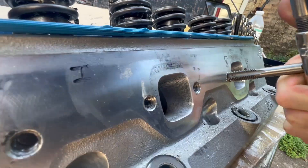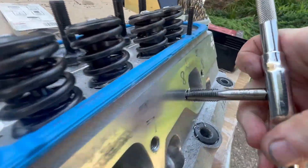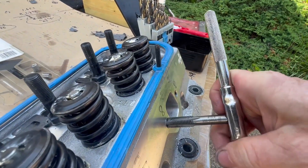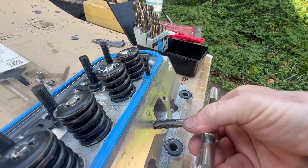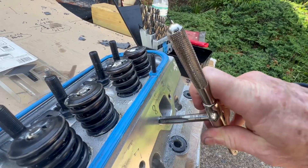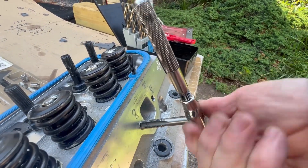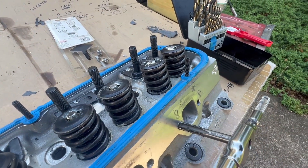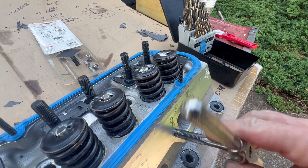I'm hand-holding the camera and trying to do this — and there we go. Now, this is aluminum, and you can kind of just keep going forward the whole time, although it's a good idea when you're tapping to go in a little bit, back a little bit, in a little bit, back a little bit. That helps it not get stuck, and you don't really need any lubrication.